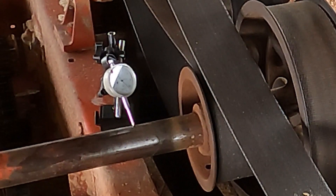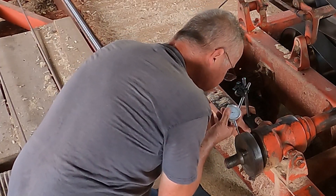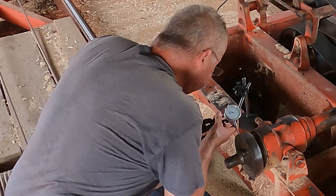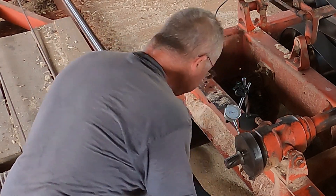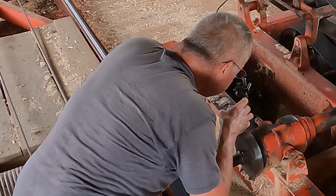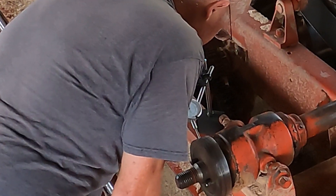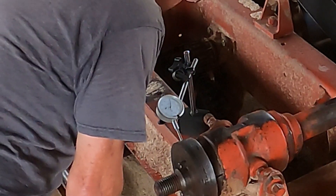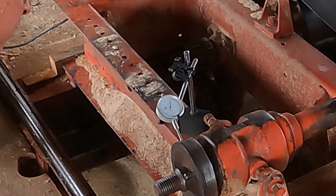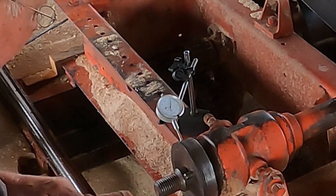We do want to measure the fast collar. According to John, it's the fast collar — I don't know why it's called fast. I'm going to do it running so I can see the dial indicator jump up and down. It's pretty smooth. And then we go to two or three thousandths. As I recall last time I did this on the face of it, we got three or four out of it. John said on the fast collar — which is the one attached to the mandrel — that's more than it should be.